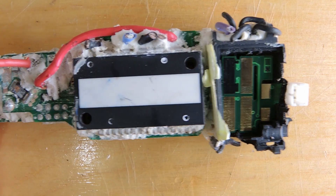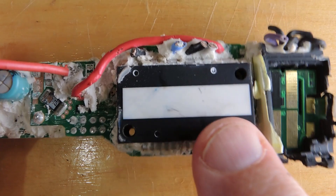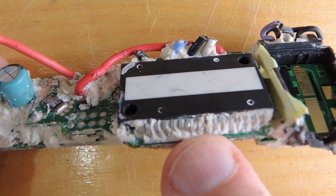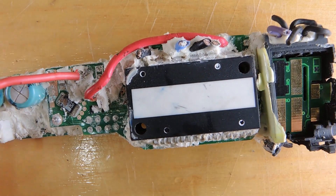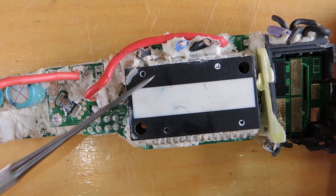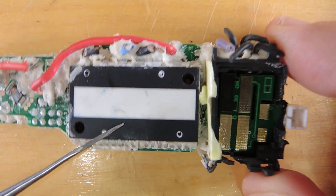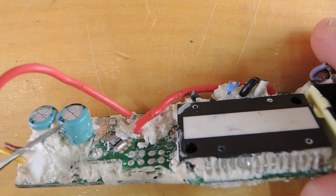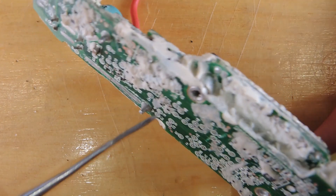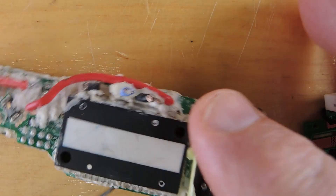Partially de-encapsulated now — you can see a bit more of the electronics. The most important component here has wider leads on one side which drive out to the motor and finer leads on the other side — a good indication this is the power electronics. I don't know how complicated it is or whether there are processors hiding in this package, but generating these fields correctly is relatively complicated. Otherwise it's just a couple of electrolytics, a power sense resistor, and a small scattering of discretes. It's cordwood construction, so the processor may be hiding under this section. The power switch just fell off — you can see it was gold-plated for good service life, and this black section is likely resistive ink for a speed control wiper.